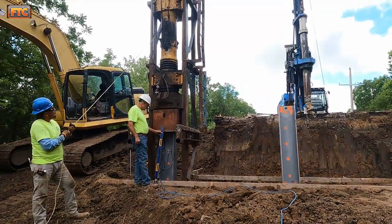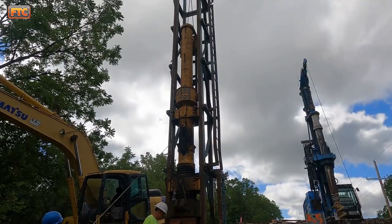For a typical hammer operation, you get a blow roughly every second. Here's a video of the mechanical trip for the hammer ram. We did this on a job where it was pre-bored to limestone rock and the pile was set in the hole in hard limestone. We were concerned that if the hammer operated under fuel it could lead to an unsafe situation where the hammer ram would fly up too high and risk not only damaging the pile but having the ram blow out through the housing. So we just did manual trips, did the PDA that way, and got our required capacity without actually running the hammer under fuel.